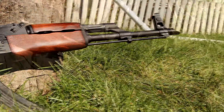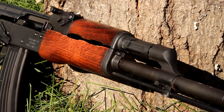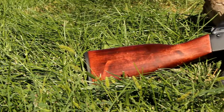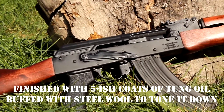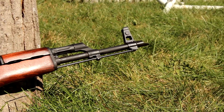I refinished it starting off with some Minwax red mahogany stain — did about five coats of that — and then moved to a scarlet dye mixed with alcohol and rubbed that in. I only did one coat of that because I thought it was red enough. I didn't want a really truly bright Russian red; I wanted just a hint more red than came with the Minwax stain.